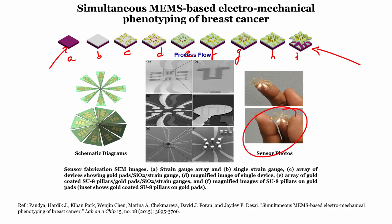It is about understanding what the first wafer is. The first wafer is an oxidized silicon wafer. Then what is there on the oxidized silicon wafer? We have PDMS on the oxidized silicon wafer. We will cure the PDMS. What is the next step? We will have chrome gold interdigitated electrodes. What is the next step? We will have PEDOT:PSS spin coated and patterned to form piezoresistors.